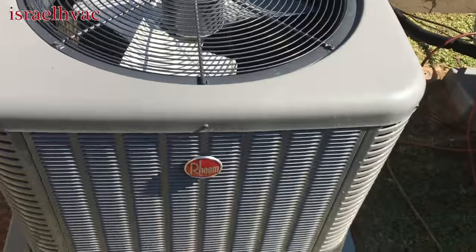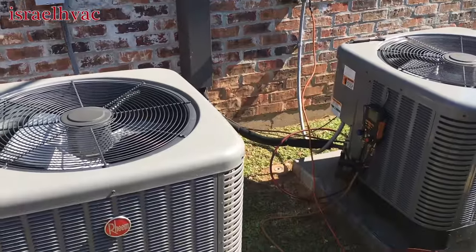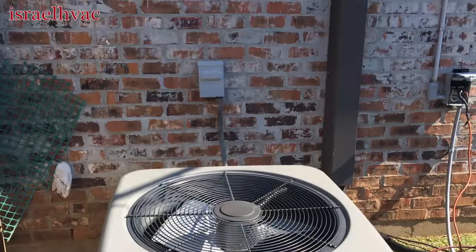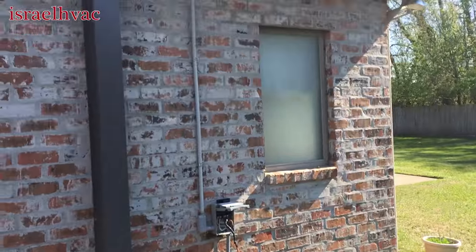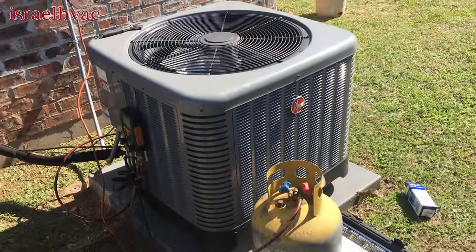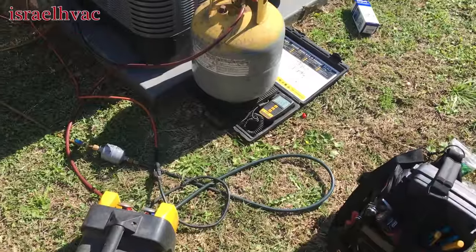I set both of these at the same time. This house had one five-ton and that wasn't enough air, so we put two three-tons — one there and one there. You can see this is the original; this one had to be added. There's a line set cover. We had to get an electrician to run a line and put a disconnect. The job came out great, but the outdoor TXV has failed for the heat pump cycle, so I'm in recovery process.